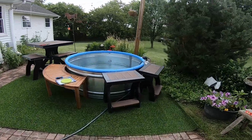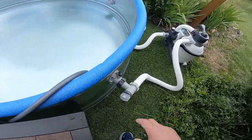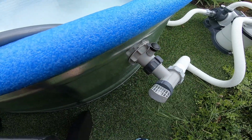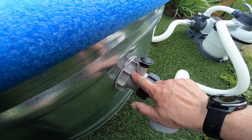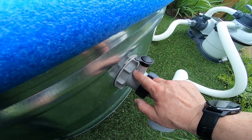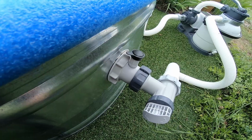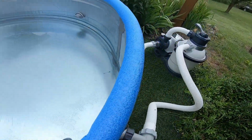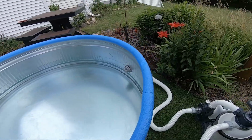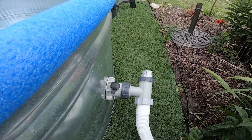This is where we're at. We had one major problem. You do not need the extra washer on the back end. And the reason why, because that bad boy will not fit, because that ring comes out too far. So skip that part, you don't need it. Maybe get them for next year or whatever if you're taking the filters out next year. But had a huge leak. Found it beforehand and made the change. And now we're not leaking.